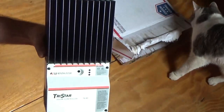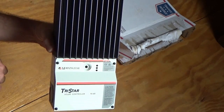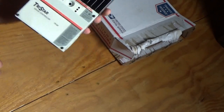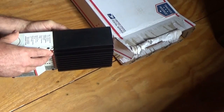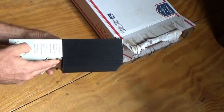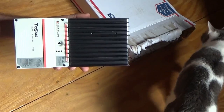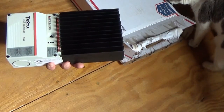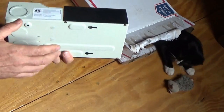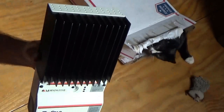Winter is coming, and I really need to improve this situation before winter sets in fully. I really need to improve my solar power production, and this is going to have a big play in that. I'll be installing this today — no time wasted. This is 60 amps maximum capacity with a surge of 75 amps. I'm going to load this up with four solar panels right away — about 800 watts — which should keep me under 75 amps, especially with the amount of clouds we get. I'm going to have two sets of solar panels on two different solar charge controllers running at any given time.